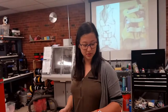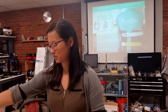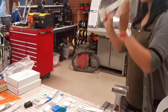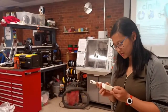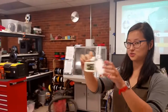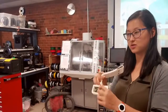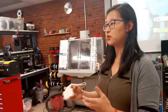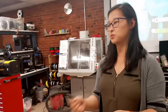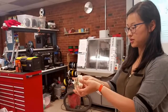This is one of our early prototypes and drawings, and this is what it kind of ended up as — pretty similar. In the process, we went through a bunch of different iterations with 3D printed models. We started off using fairly big components soldered onto protoboard. We also ripped the load sensor from a luggage scale — basically tore apart a luggage scale, took out the circuitry for signal processing, and put that in. We were able to show that it worked: we could put it on a brace and measure how tight it was. Then it gradually became integrated into a single module.